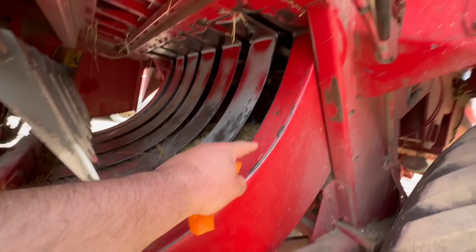These are all the different takeoff points. PTO shaft, power takeoff shaft it stands for, goes up here, up there like that. And then it turns this big flywheel, this huge, huge flywheel. And that also drives a little fan pump, but I can turn that. That's a slip clutch. Inside here is a huge gearbox. Just there.